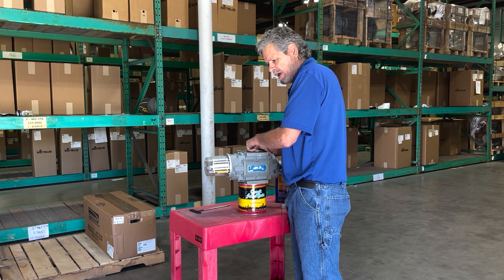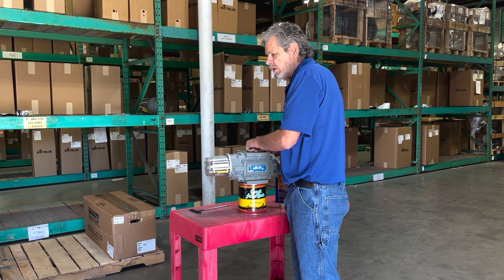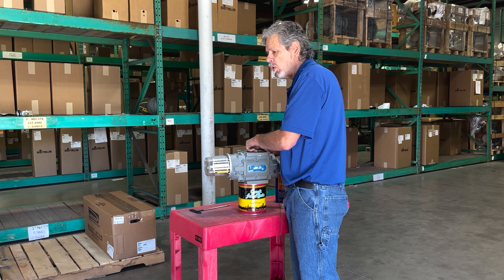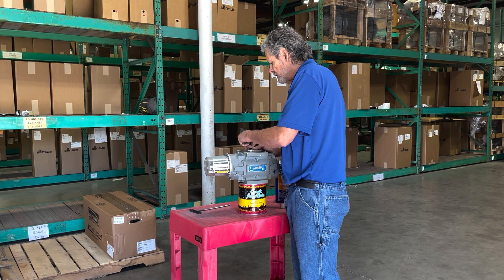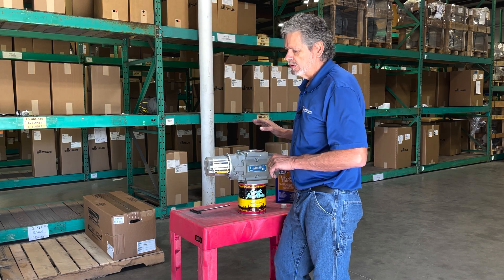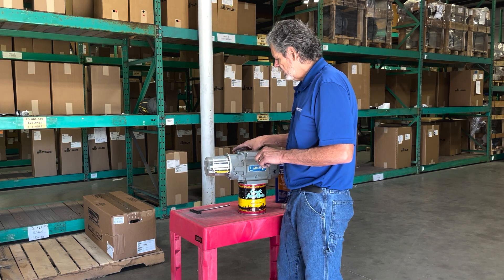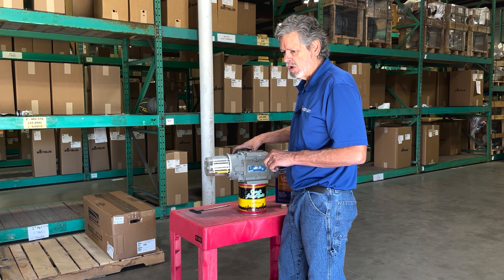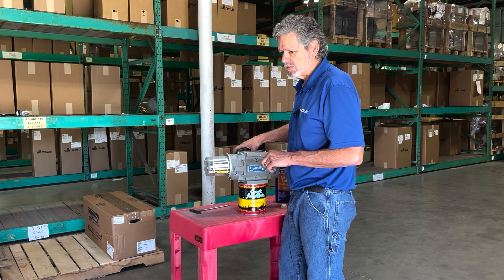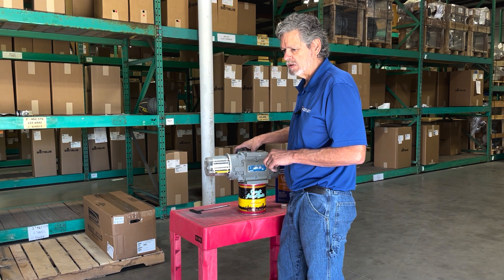If all attempts fail at freeing up the impellers, something is either lodged, the impellers are damaged in some way, or your timing is off. At this point, adding any more fluid to the meter is not going to solve the issue, and the meter will have to be taken apart and inspected for any other damage — or an axle on the impeller being bent because it is out of time.